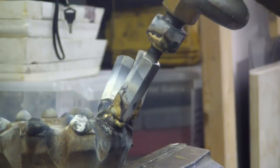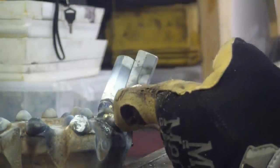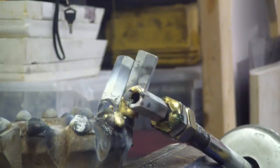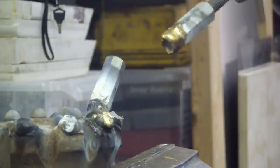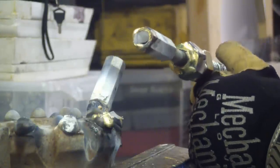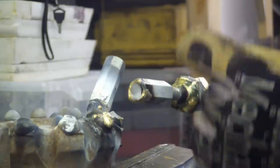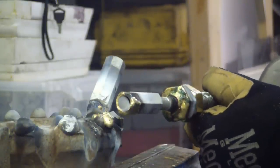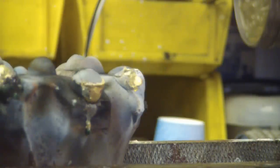Failure, take one. The brazing did take away a chunk of the tungsten carbide where it was attached. Brazed tungsten carbide removal — fail number two. We've had two complete and utter failures and we can see what's going to happen. This one had a lot more meat on the brazing and it just took the top of the carbide off — it must be real brittle in tension. Attempt and fail number three. Three for three — this method doesn't work.